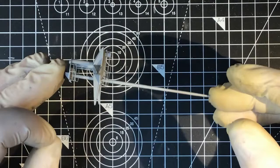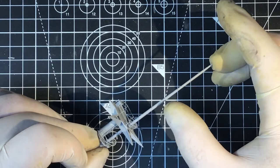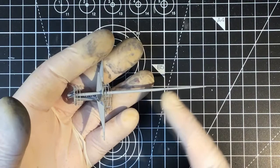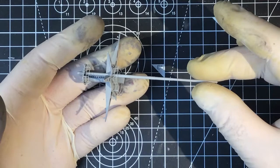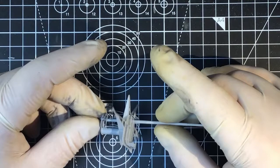That's all primed again and the next job is to do the white. I'll come up about an inch above the starfish platform at this stage — I can always blow in the rest of the white later on. I don't want to apply paint all the way up, because these little brackets that go on the mast at various stages are very precise fits, and extra coats of paint where you don't need them can obstruct the fit. Nice soft easy coats is the order of the day.